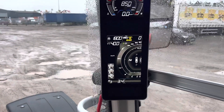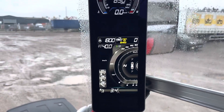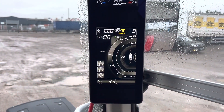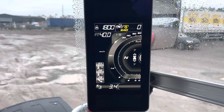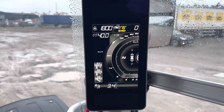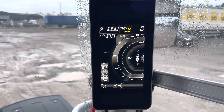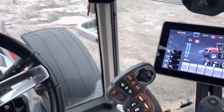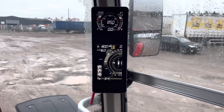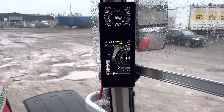When you first start the tractor up this is what you come with, and obviously it can be set however you've wanted it to be set or the last time you drove it. The critical settings are there. There's a speed set at 40k — just for reference on Dyna 7 and Dyna E-Power, if that is only at 40k that is how fast it will go. So what you have to do is come to your multi-controller joystick and on the roller here, if I roll that up it just changes that speed, and then when you accelerate it'll go to 53k.